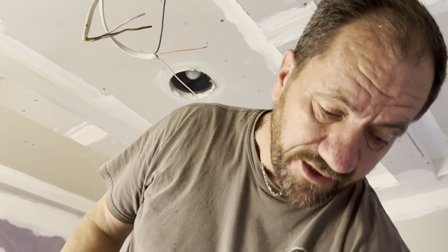For the floor we both agreed: dark and dramatic. We're looking at this tile in a 24 by 48 format for the shower floor. The shower is 36 inches wide and 10 feet long, so a 24 by 48 gives us a grout joint every two feet — only four joints total. We'll do what's called an envelope cut so we can use that large tile on the floor, with diagonal cuts from each corner to the drain. I'll link the envelope cut video below — it's a short, about 59 seconds.